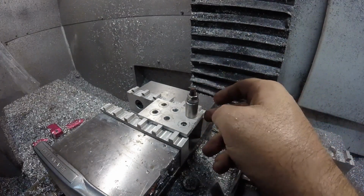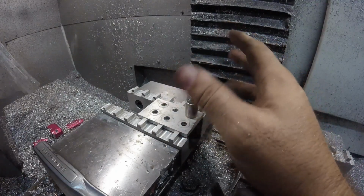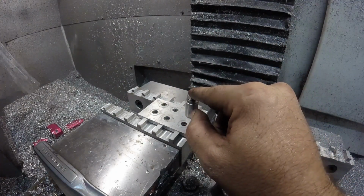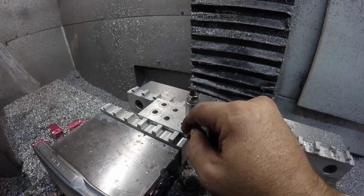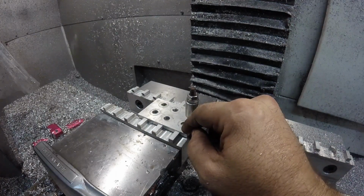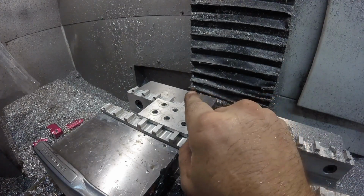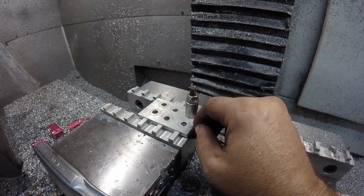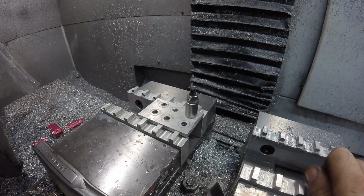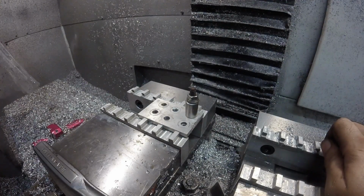So, if the stud can go all the way through, full threads on the stud and on the hole, 30 to 35. If the stud has to bottom out in the hole, well actually that was without chamfering too, full threads, so maybe 30. If the stud bottoms out in the hole and you can't get this last little bit, then somewhere between 20 and 25, with 20 being safe. And just for reference again, the bolts on a cylinder head are 18 foot-pounds. So 20 should be enough to hold whatever has to be held.